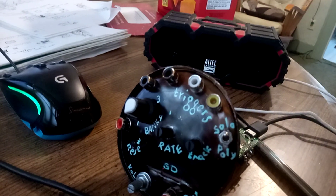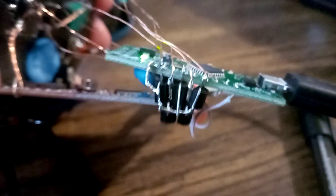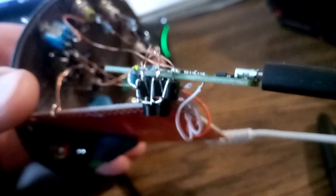I have it plugged into a speaker. I don't have a way to trigger it right now, so I'm just going to be touching the inputs. It's an Arduino. The triggers are triggered with transistors, which you can see right there. There's five transistors and four triggers.